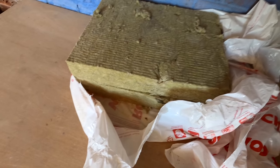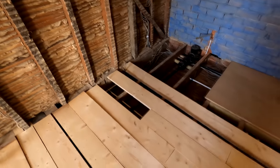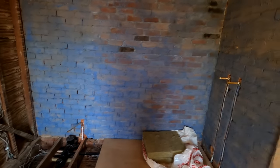We always use this product. It's really fantastic. It's basically fireproof, very, very good at sound deadening as well, so in our opinion it's a great choice to use in any application. Stud walls, floors, ceilings, it makes sense to use it. So yeah, we've got Elements board to go in here as well, there and there. For the rest of that wall, it will be lime plaster, and above it as well.